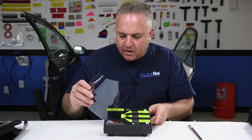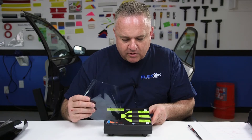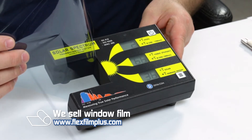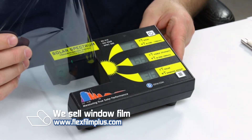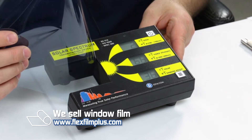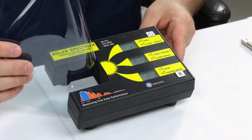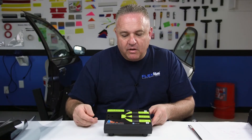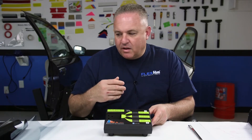This is a light window film. I'm going to put it in here and it's going to show me all these transmission specs. The top one says it's going to let 2% of the UV through, so it's a 98% UV rejection. It's 66% visible light transmission. The bottom is a 36, which is a number that really shows us how effective this film would be if we put it on a house or a building. The higher the number, the less effective it is. Visible light and UV contribute to fading in fabric and paintings that fade on the wall. If it's a real low number, it's going to eliminate or almost prevent a lot of that harmful fading and UV damage.